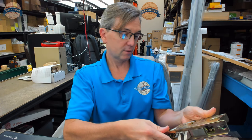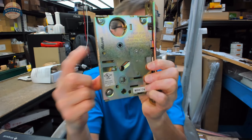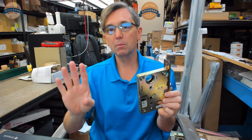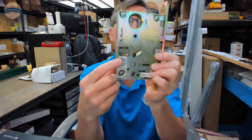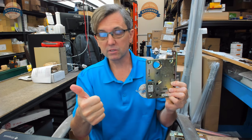The other reason you have that is this UL label on the lock. This lock is listed, which means it's been tested and found in compliance — it has a listing on file with the testing laboratory, in this case Underwriters Laboratory. It's therefore also labeled. Almost all hardware on a fire rated opening will most absolutely be listed, and most items will be labeled. An opening is everything: the door, the frame, the hinges, the closer, the lock — everything.